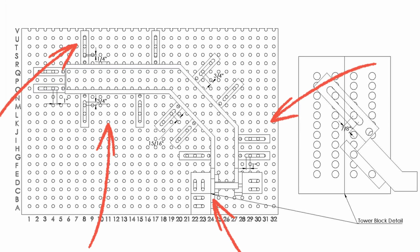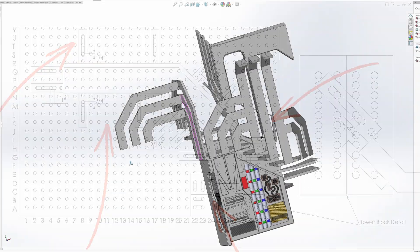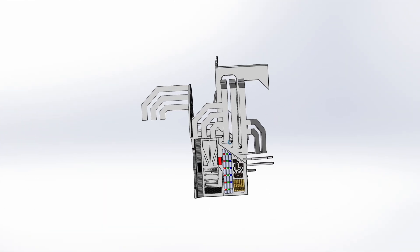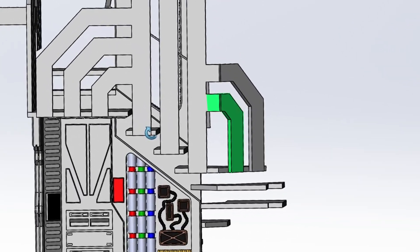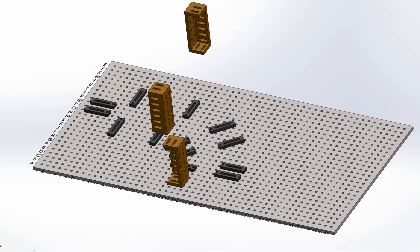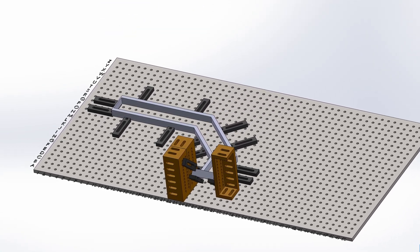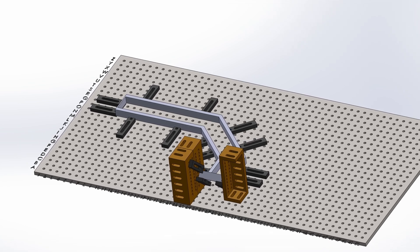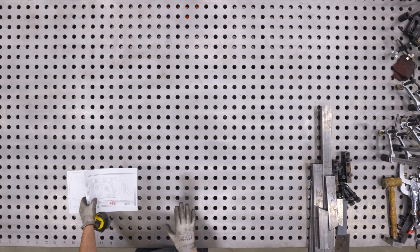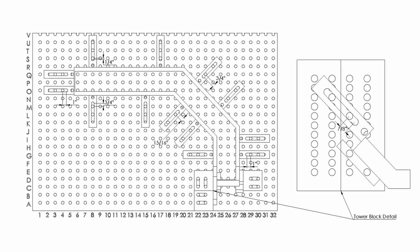You're probably wondering how I got this fixture placement drawing. It's actually pretty easy — it all started back in CAD. I have all these stairs already modeled into a 3D space. It was as simple as isolating the component I wanted and dropping it onto the virtual Fireball fixture table in another CAD model. From here I can view each individual piece and place virtual fixtures all around the component, giving me precise tooling locations. With this style of fixturing, I have a cut length drawing for all my material and then a fixture drawing.